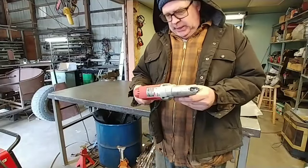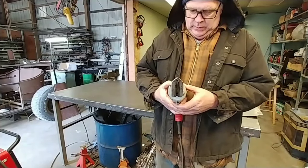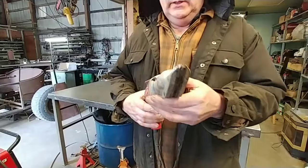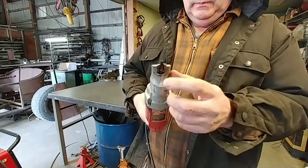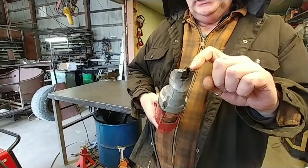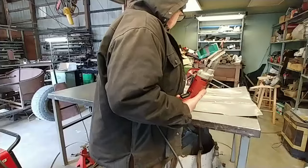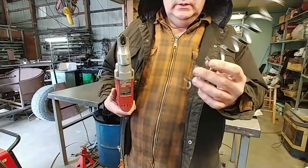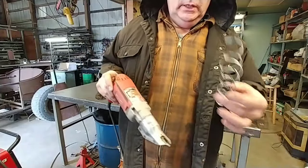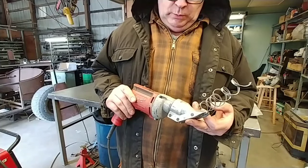Okay, so this is a Milwaukee. It's called a 18 gauge shear. And the way it works is it's got these three fingers up front here, and this middle one moves up and down. So it shears in two spaces. Shears there and there. And also it creates these nice curlicues, so you lose that much material. So it's a double shear and I end up with that piece out of there. So that's what it says. Milwaukee heavy duty 18 gauge 1.2 millimeter shear.